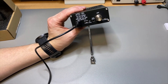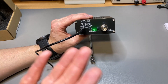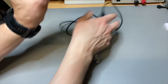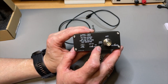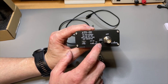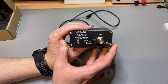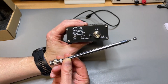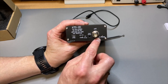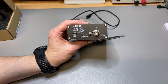There's an LED for charging status — I think it's red when empty and green when fully charged. It was already green when I got it, so maybe it came pre-charged. You also have a headphone jack here, and the cool thing is that in FM mode you can use your headphone cable as an antenna — so you can put it in your pocket. You can also use a telescopic antenna. There's an FM/AM button here for the higher frequency range, 64 up to 108 MHz.